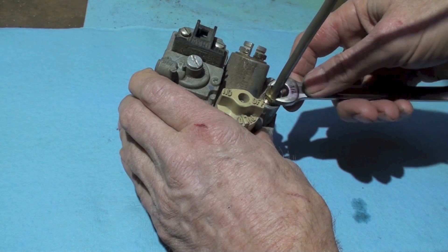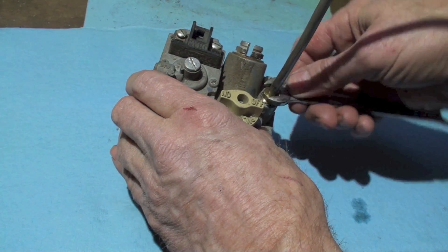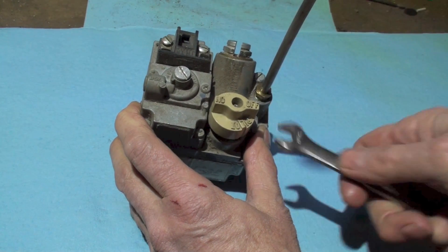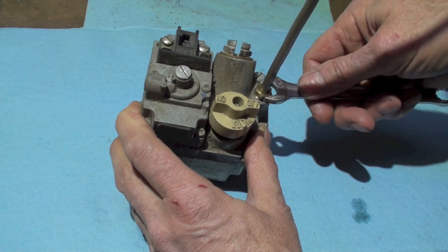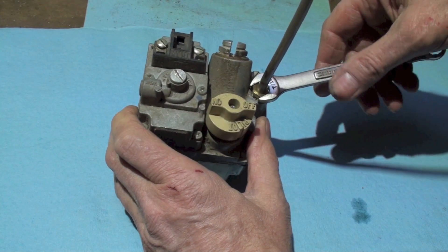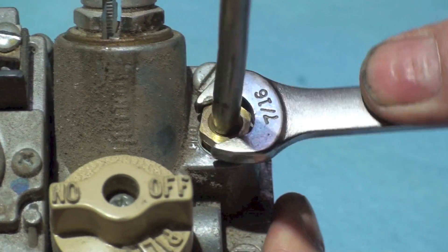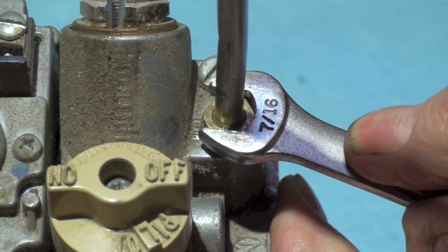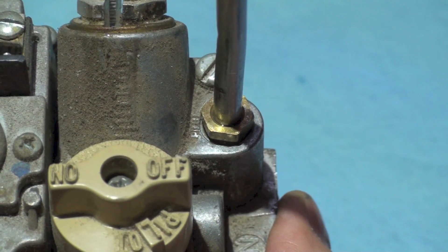Because I've lubricated this with a little bit of oil, it should turn easily. If this thing turns about a half a turn and then starts getting hard to turn, you're cross-threading — back it out and try to get it in again. You can ruin a gas valve if you don't get this right. Now I'm getting some resistance as it tightens up, and as I get it tighter and tighter it's going to break off — and it's broken off and it's in tight. That's the easy way to do it.